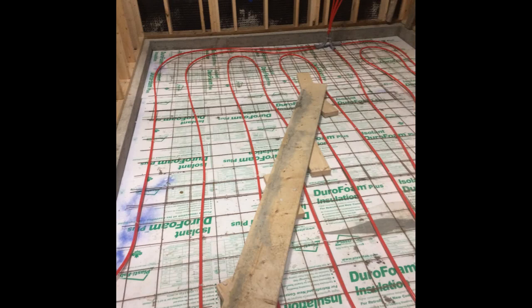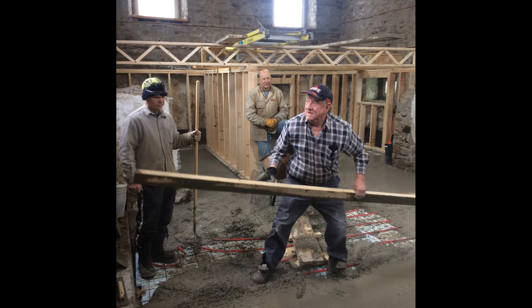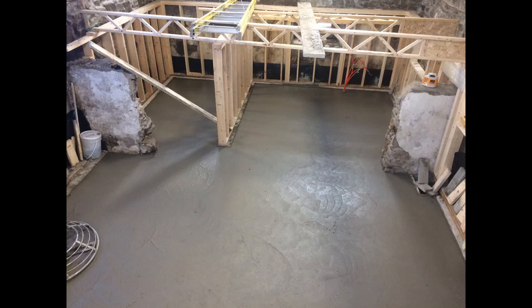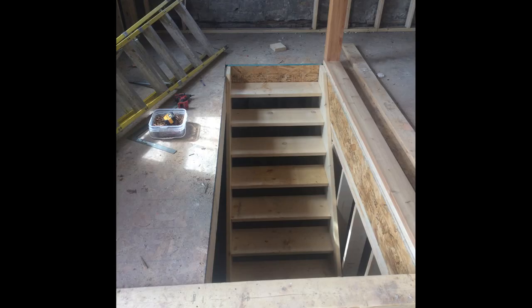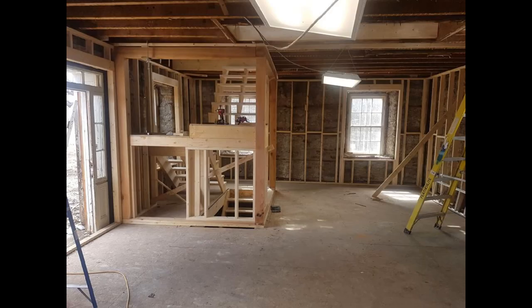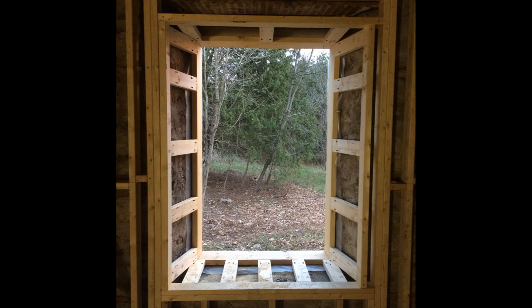Engineer floor joists were used for the first floor. Once I could get the basement dry, we laid three inches of rigid insulation and then in-floor radiant heating tubes zip-tied to wire mesh. With the help of family and friends, we were able to pour the floor in the morning and my grandfather and I spent the afternoon finishing it as it cured. It didn't take long after that to finish the subfloor and framing. It was exciting to see the stairwell go in and the stairs be installed — it was a few months of climbing ladders to move between floors. The window wells took a while to frame but we loved how they turned out.